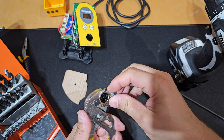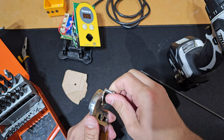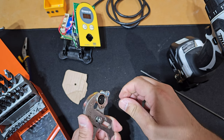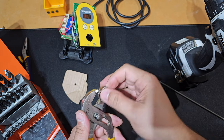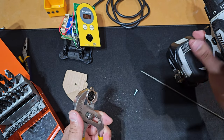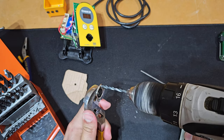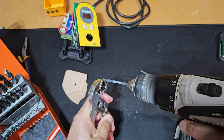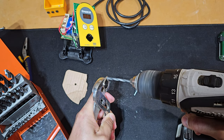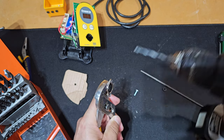The last thing I want to do is drill so fast clockwise that it destroys or breaks apart the metal or deforms it in any way. So if you go backwards, you're going to eat a little bit less metal, and it goes slower, and you can see it's much more controlled when you're trying to drill through.